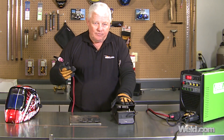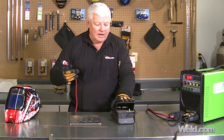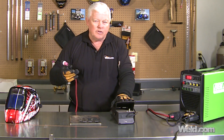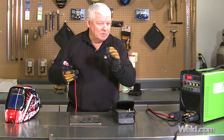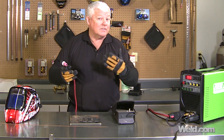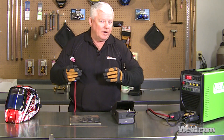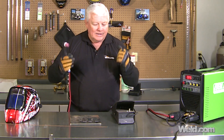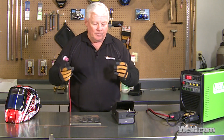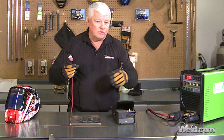You can back off, and when you start finishing your weld you can taper off, let your puddle re-solidify, and hold it there at about 6 amps. You'll find this machine is going to be very popular with gunsmith-type people — if you need to just put a little spot or do a little repair, this works quite well. It's not super heavy duty, but it does work well. I'm going to do a little bead-on-plate to show you how this foot control works.